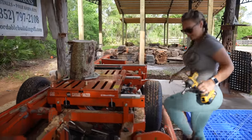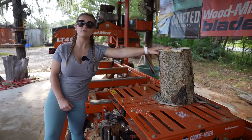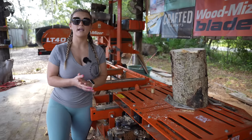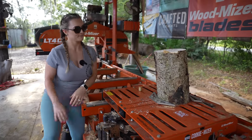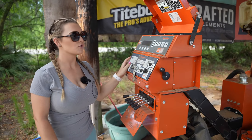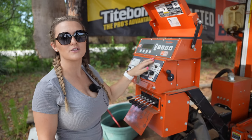She's sturdy. This is a monkey pod log that I have up here. You've seen us cut these logs several times here at the sawmill. They're really cool because they have the really light sapwood and the really dark heartwood. So I think they're gonna make some really nice cookies. Most of the cookies we cut here at the shop are 1 inch. So I'm gonna use our AccuSet and set it to 1 inch and they're gonna cut exactly 1 inch cookies all the way down the log.